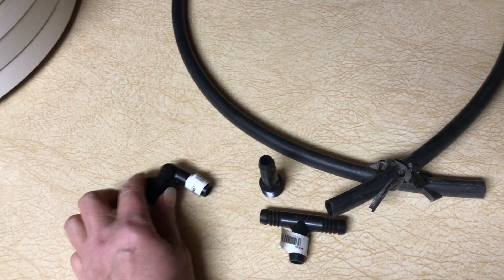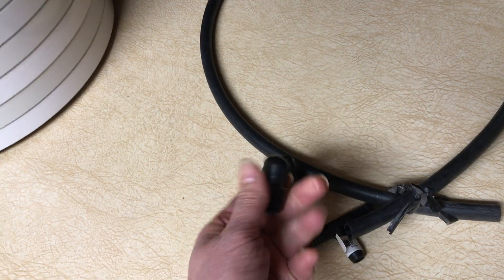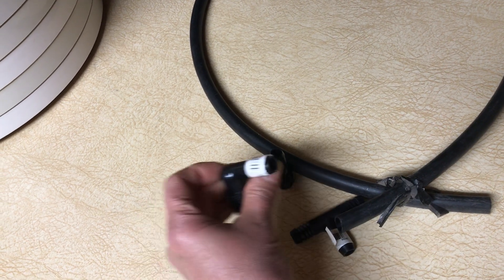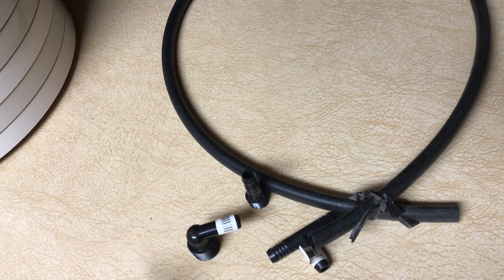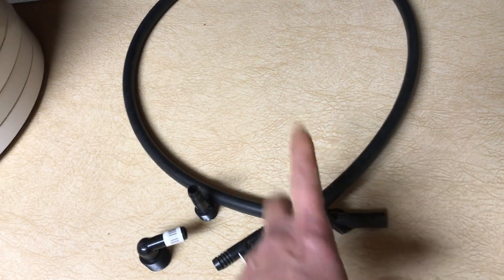It's really hard to get parts out once you push them together. Always, always, always — the first thing — screw this into your PVC coming out of your sprinkler line before you put any funny pipe on, because you cannot spin the whole assembly around with the pipe already on it. Screw that in first, then push the rest of the pieces on once you've got it dug and you know where you want the new sprinkler to be.